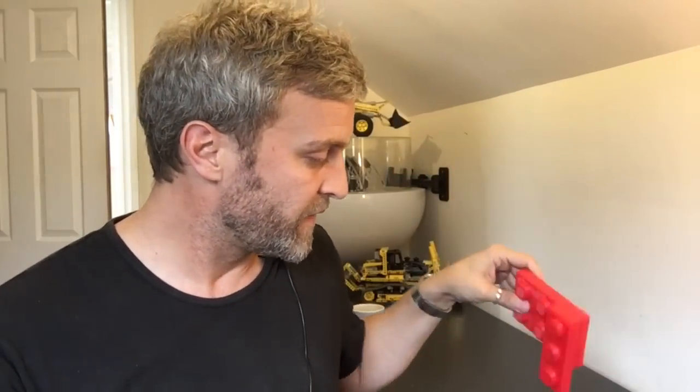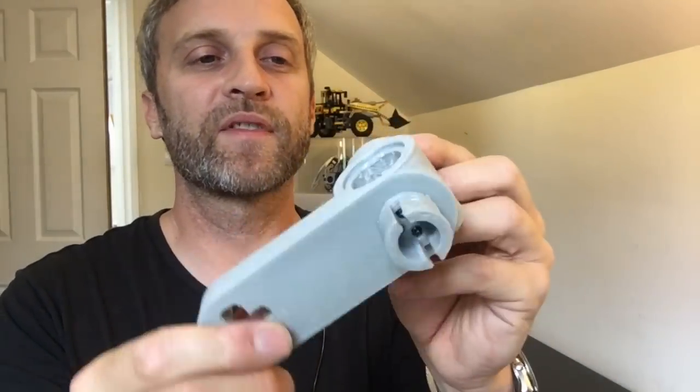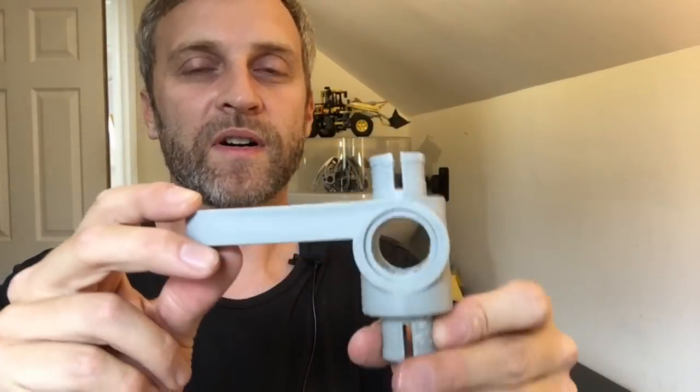I spent a lot of time getting the fit right on parts. I found some CAD files online — there's quite a lot on GrabCAD and similar sites — and I also found James Bruton had links to some SCAD files, which are mathematical CAD where you can type in what size you want, like a two-by-three piece, and the CAD generates it. The problem was there were errors in the SCAD files and the scales weren't quite right, so things weren't always fitting together. I made my own adjustments and played around until I got nice tolerance fits.